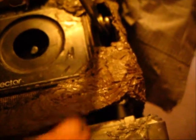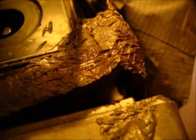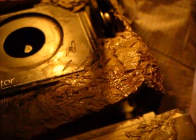Now we got that piece of metal melted into the plastic, and it's a little stronger. You can't really see it — the piece of metal is in there somewhere. But at least if that cracks, hopefully that metal will make it stronger. Really I should probably melt another piece of metal in there just to be sure, but I don't think I'm going to. If you're out there and you got to weld some plastic, you can always melt the plastic back together. I put a piece of metal in there — I want to see how well it does.